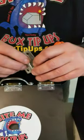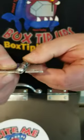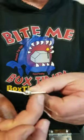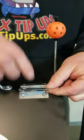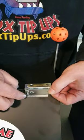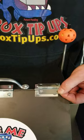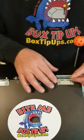They have a flat side, and then they have one side that has the curve. So you can see this side here has the curve where it actually attaches and then it curves down. This would be the flat side right here. So the flat side is going to go on the box. That'll actually go on the plastic. The curved side will go on the lid. And it just gives you a little bit more room in there to prevent binding or anything. So if you notice anything binding, double check that. Make sure you've got those hinges correct.